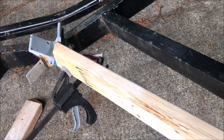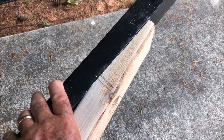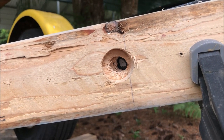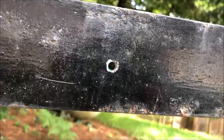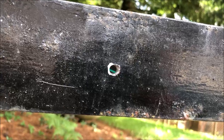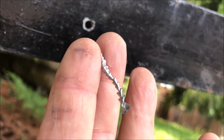After I had the front end all figured out I just held the board up to the trailer and traced it. I cut one of these with a hand saw and one with a band saw — it's a long slow cut with a hand saw. I made a countersink for a three-eighths bolt to hold the board to the trailer. I went over to Home Depot and got some brand new sharp bits, center punched it, and did a quarter-inch hole on each side. You'll know it's sharp when you get a curly cue like that. Go slow, push hard.